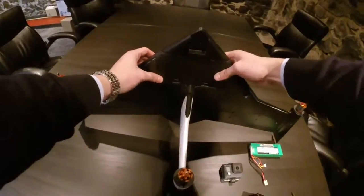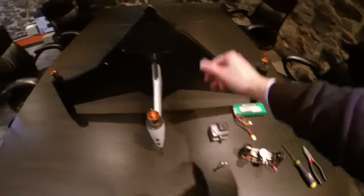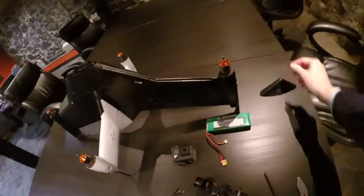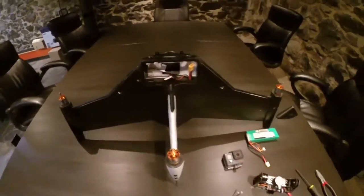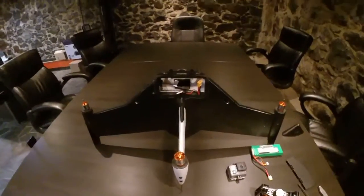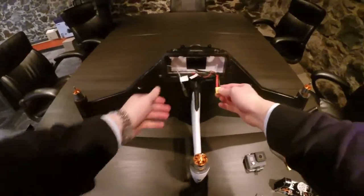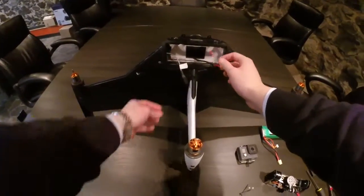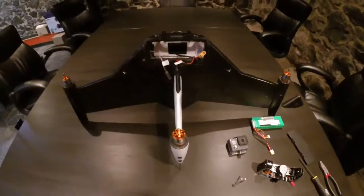Let's turn this thing around. Now, if your nose cone is installed, you're going to have to remove that with these bolts and nuts. I've already done that, so the nose cone just comes off — we'll set that aside. Next thing you want to do is remove the battery hatch. Inside you'll have at least two wires; some of you may have three. This one is for power, this one is to connect the power to the gimbal, and this one is for FPV if you have that in your unit.